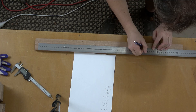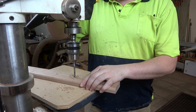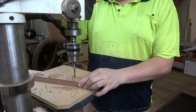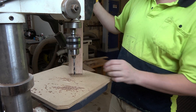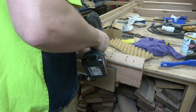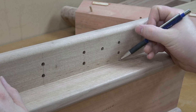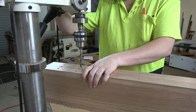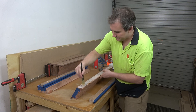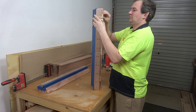Then I can mark and drill out dowel locations into the underside of the upper side rails. To locate the upper rail to the header rail, I will just use three dowels hammered in from underneath. Using the upper rail, I can transfer the dowel locations to the lower side assemblies I made earlier — this way I can be sure that all of the side slats will run vertical. Then I can glue the upper rail to the upper header bar using rubber bands as clamps, because it is a pretty weird shape which didn't work very well for normal clamps.